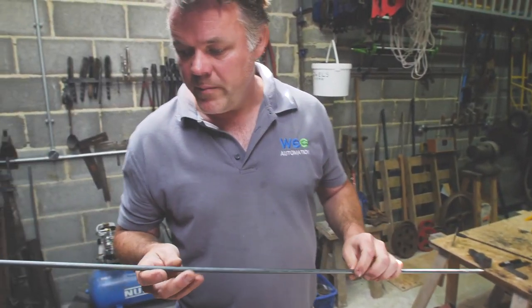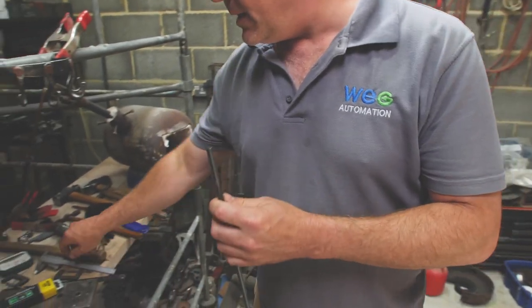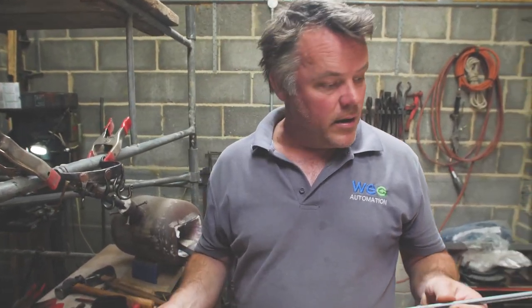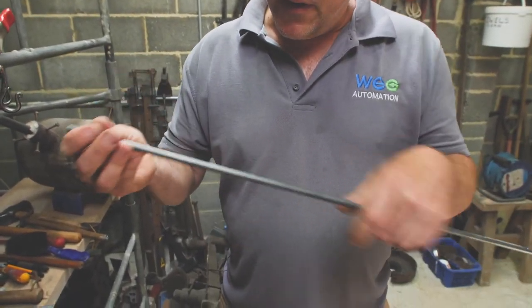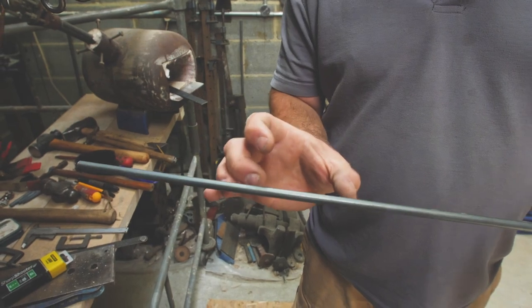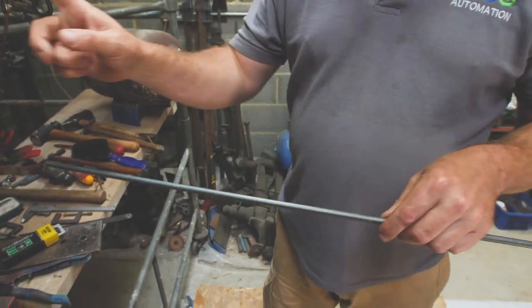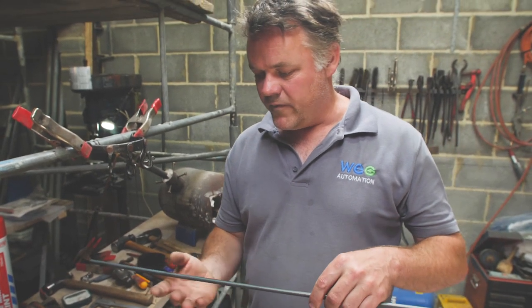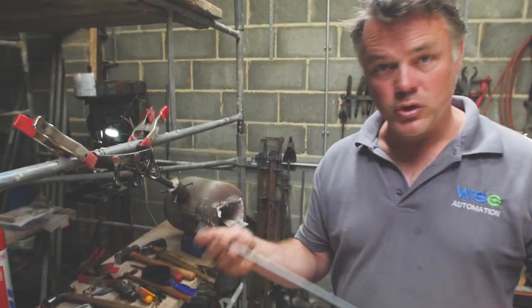This is just a little bit of 10 mil, I think. 10 mil mild. Oh, it's not. So we've got a bit of 8 mil round here. What I've done is just marked off, I think, 80 mil sections. 1, 2, 3, 4, 5. I was like an odd number. I think that'll look well spread over that distance. So we've got 5 little trace hooks to make.